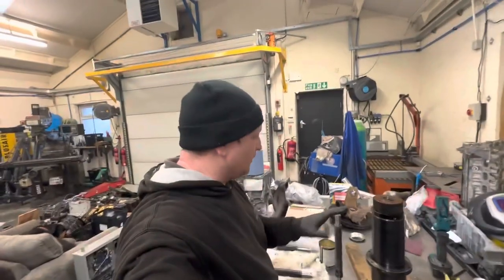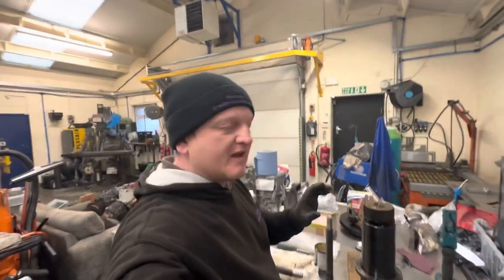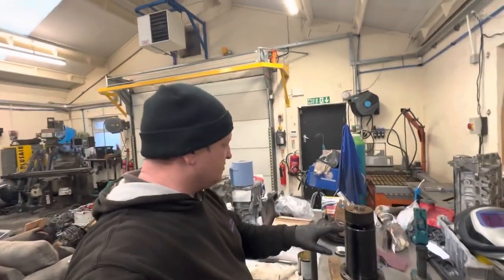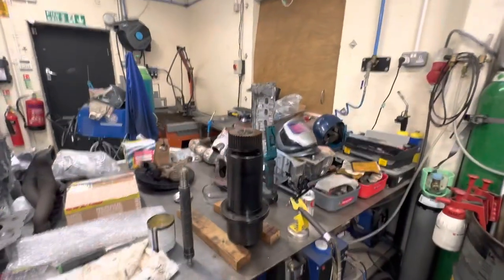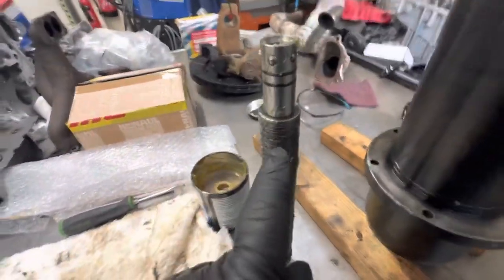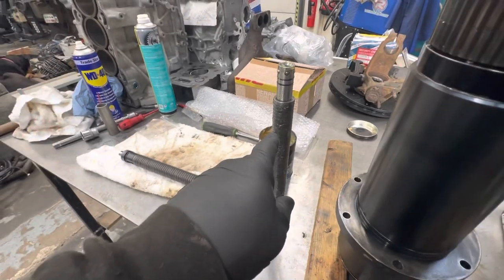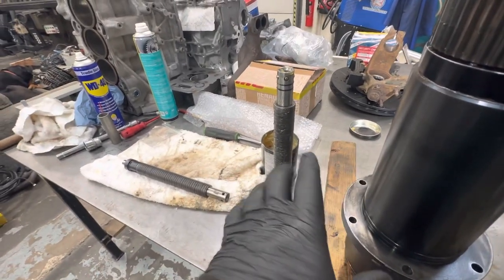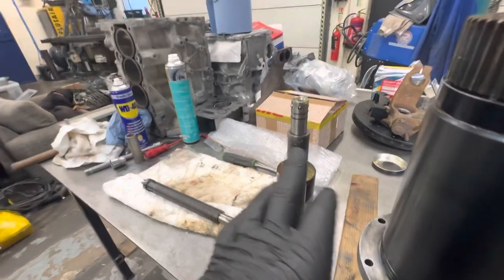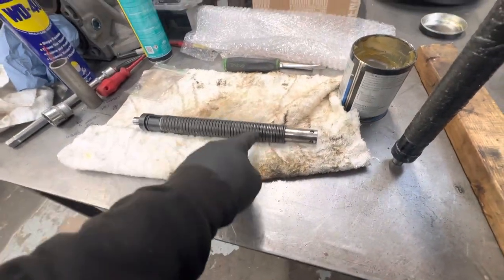Okay, so we've sorted the drawbar out, we've greased it all up. Now this is the one with the five ball bearings out of the VF3 that wasn't in this spindle originally. So, like I said, they're the same length, bar about a millimetre. Now I did find one cracked washer on this one. This very end one. Now, time sensitive, I'm going to get this fitted back in, I'm going to run with it. What I'll do in the future is I'll strip this off and I'll nick a good washer out of there.